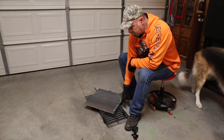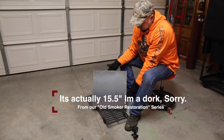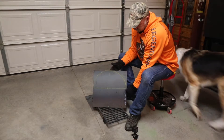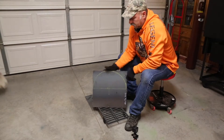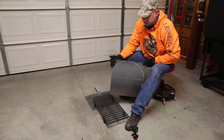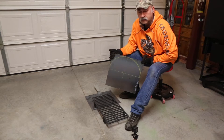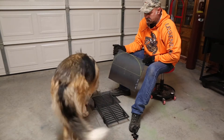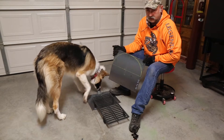The actual pipe on the inside diameter is 13 and a half. So what we've done is we've come in here and marked this, squared it up, did it on the 15 and a half inch side, and you can see we're going to end up needing to cut this half-moon piece out. We've got a fire grate to keep it up off the ground, because if you blow that hot metal down it'll pop your concrete. And I've got another piece of steel that we're going to use later inside the firebox to make a heat management plate out of — got it down on the bottom just to protect the concrete.